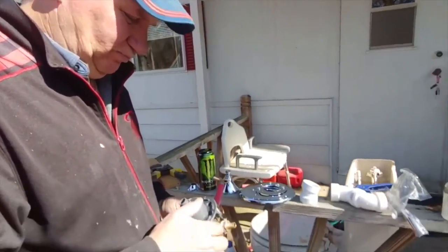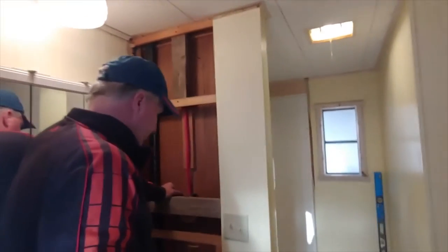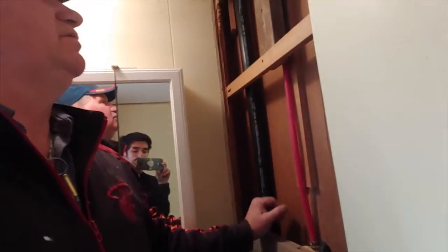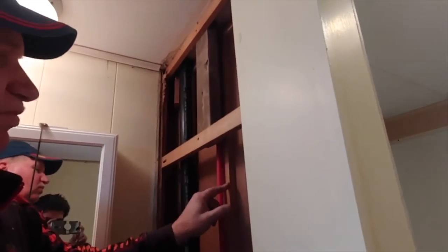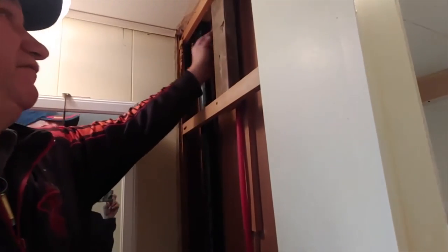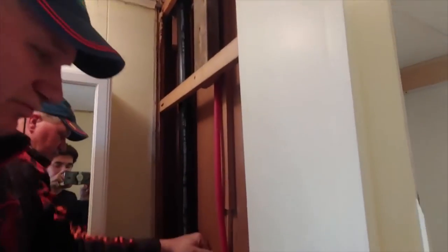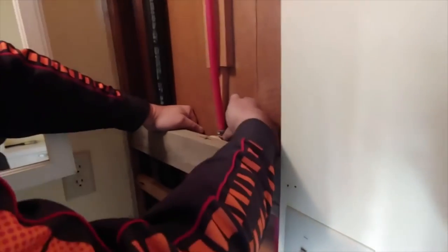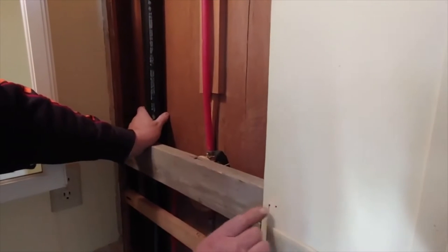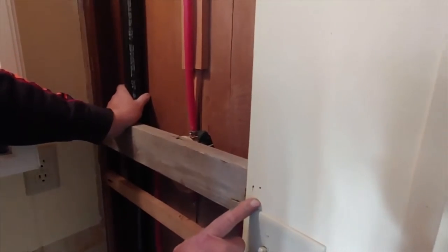Putting this faucet in this mobile home wall, that was really difficult. What I've done is I drilled through this one by putting in what they call a drop-eared elbow for the shower head. And then I fastened it to this 2x4 so I could get it between these two places here. That was the easy part. Then, to get this 2x4 here so that the faucet could fasten to it, I had to push this over, fastened right there, and fastened right here. But it had to be notched out around this box, the electrical box right here.